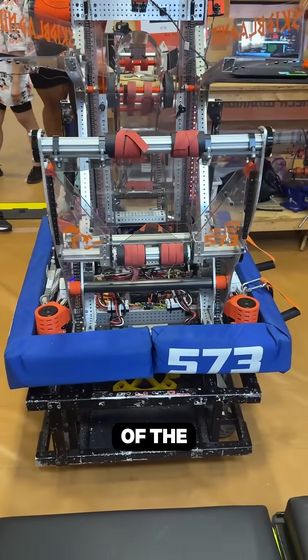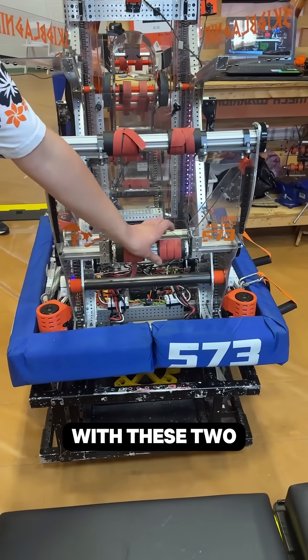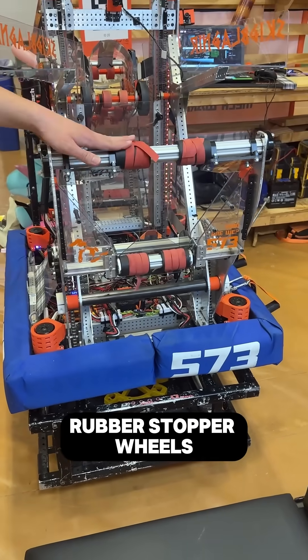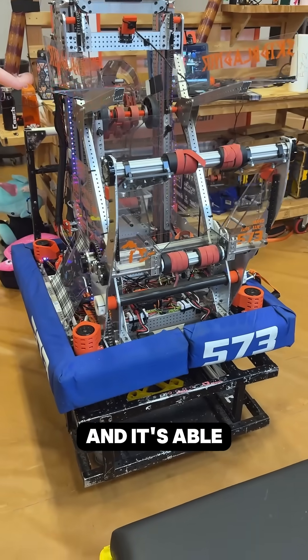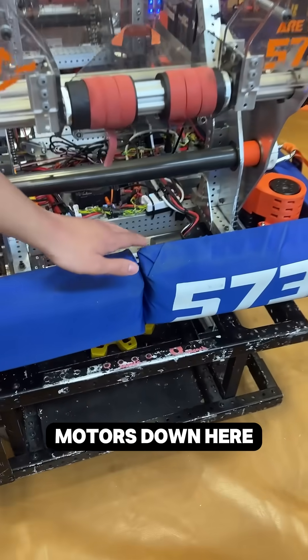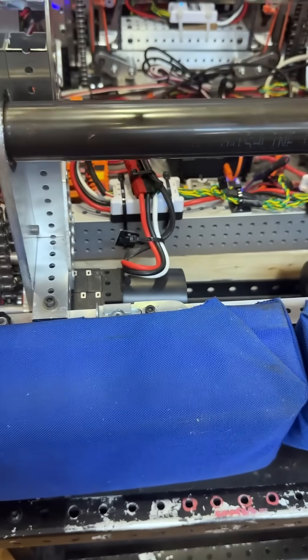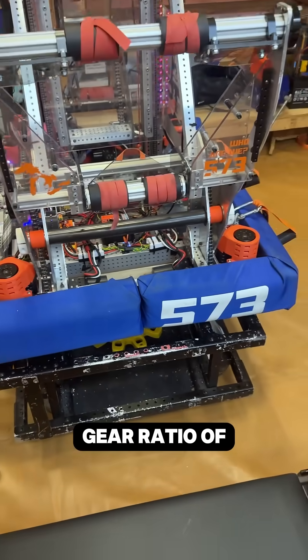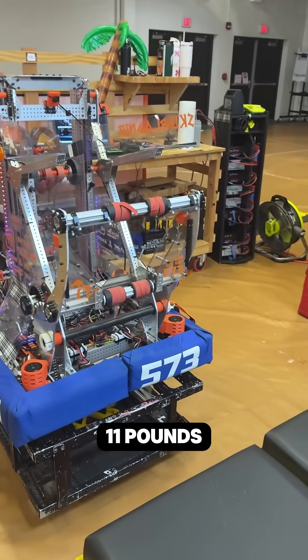The reaction of the cage reacting with these two sets of rubber stopper wheels will pull our robot back up, and it's able to do that with a high amount of torque from these Neomotors down here. It has a gear ratio of 630 to 1, allowing our stall load to be 1,100 pounds.